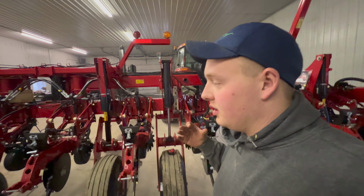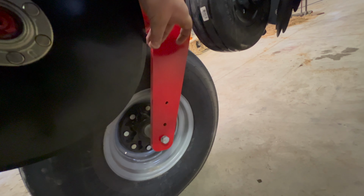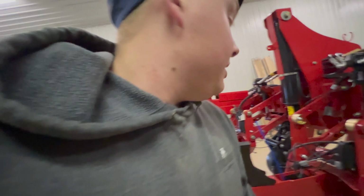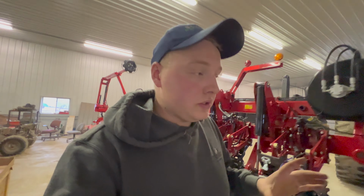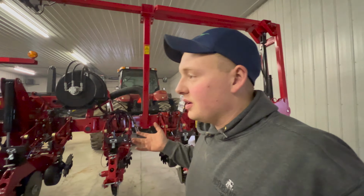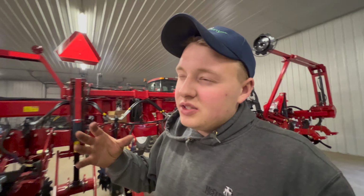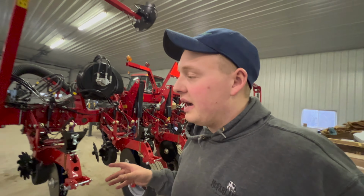They're all tight. They're all in the right spots. So you slide the two business cards in, slide them until they don't go anymore on both the bottom and the top, and then you measure the gap in between them. You want there to be a 2-inch gap or roughly close to that. We've been within a 1/4-inch difference, nothing really under 2 inches. Everything was 2 inches, 2 1/8, 2 1/4, all in that area. When it was 2 1/4, we actually switched that, two inches to 2 1/8. So that's about where we're at with that.